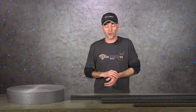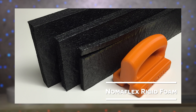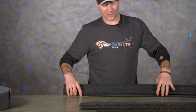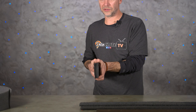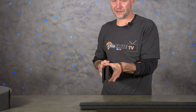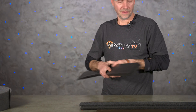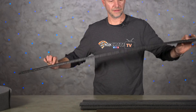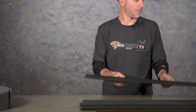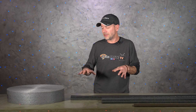The other kind of foam expansion is rigid foam — this happens to be the Noma Flex brand. This is actually a great option; it's kind of new, gotten really popular in the last five or six years. It's got some nice flex to it, easy to work with, easy to cut. The only downside is that when you're edging along it, running that edger can sometimes snag and dig into the foam a little bit, so you just have to be a little bit careful while edging up against it.